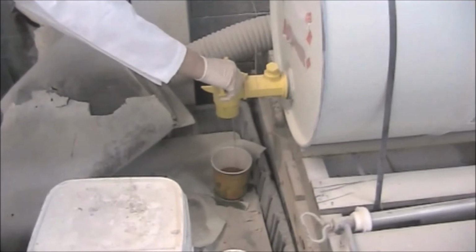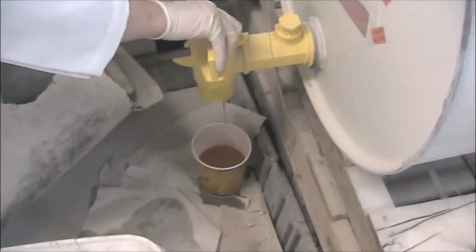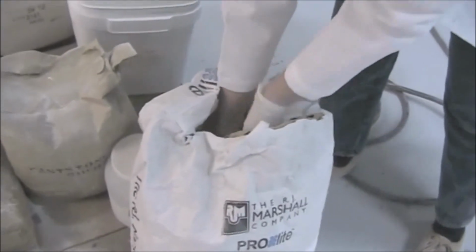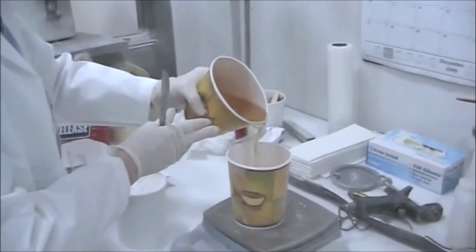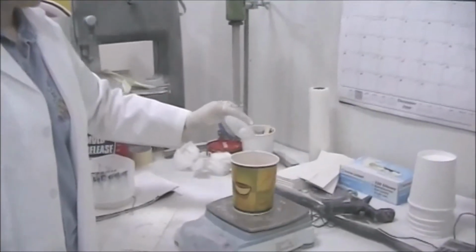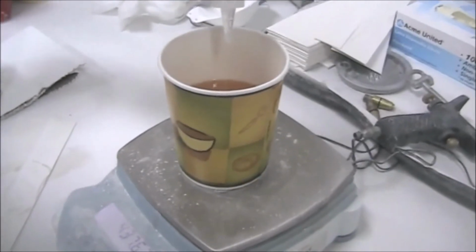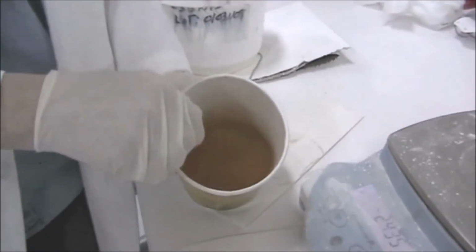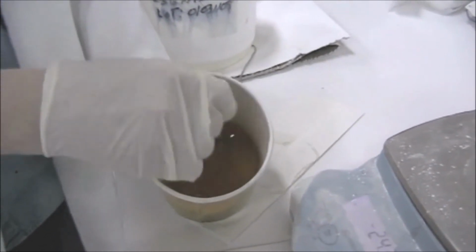When the spray granite has set up, you can add your backfill. Use a marble resin and a ProLite product to make your backfill. Lay out your resin, directly add your catalyst to the resin, and mix thoroughly before adding the ProLite. This sequence of mixing will ensure that the final matrix is evenly catalyzed throughout.